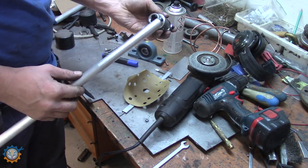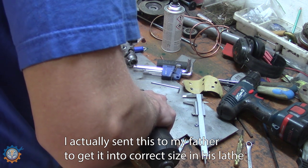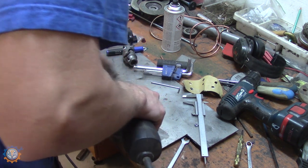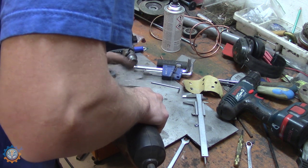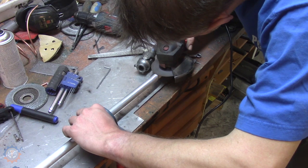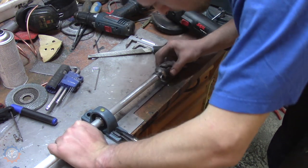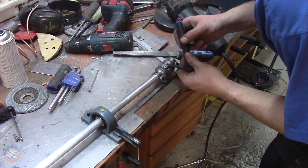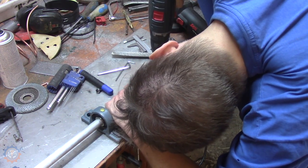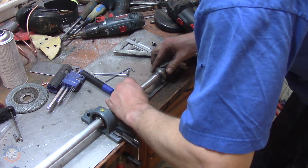The issue is this ending here is 19mm and the new shaft is 20mm. You could potentially grind it down, but you don't get it good enough without a proper lathe. What I'm doing here is just making sure the edges are lined up to the nut itself, then test fitting them to make sure there's no play and they sit really well. Marking for the holes, center punching, and drilling — and of course my head is in the way.